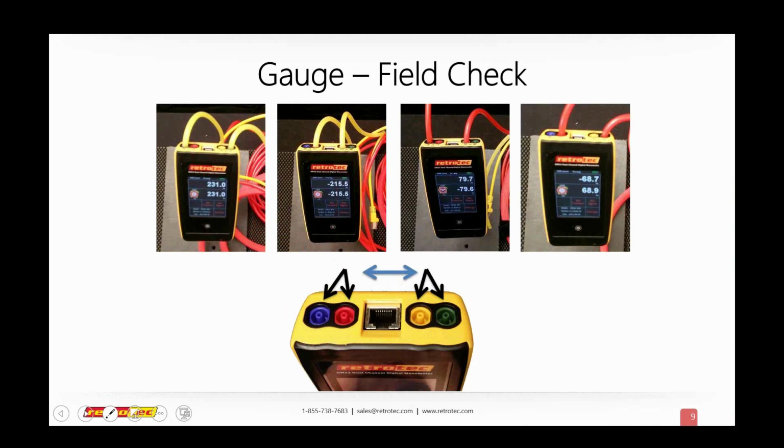So those two channels, the only thing they have in common is that they are two differential pressure gauges. They are unique, and the only connection they have is power, with no physical connection beyond that. So what you can do is take one piece of tubing, the same piece of tube, and plug one end into channel A and the other end into any port on channel B.